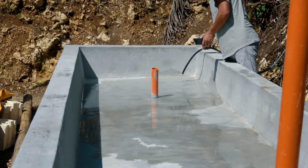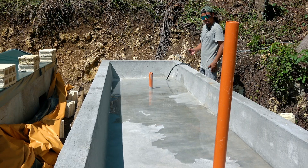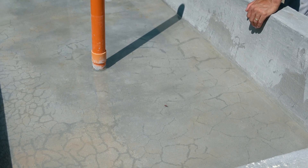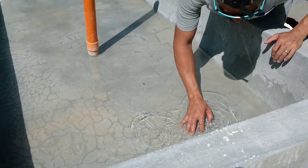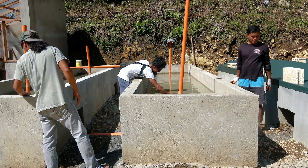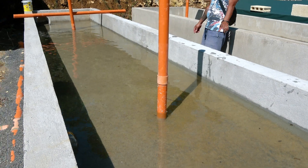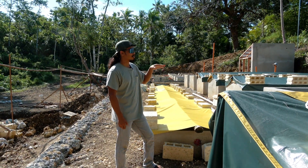There are a lot of hairline cracks in here, but I'm not sure if that's just how it cured or if it'll be sealed. The waterproofing adhered to the cement really well — it's actually a cement-based product. In some of the planters it was cracking, possibly from temperature changes, so we had to scrape, repair, patch, and reapply the water barrier. After the waterproofing we increased the height of the pipes to fill the planters with water to test for leaks and check proper drainage. There are no leaks right now.